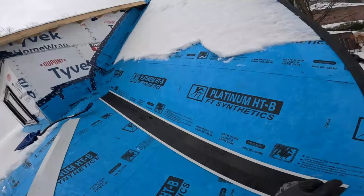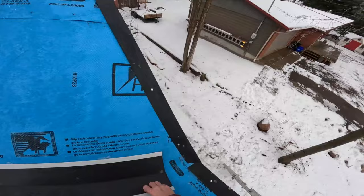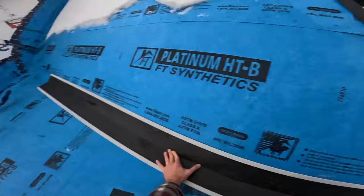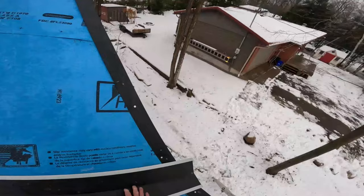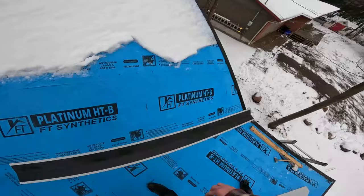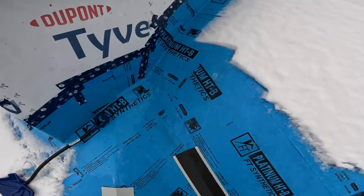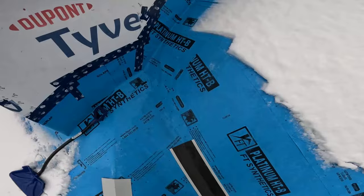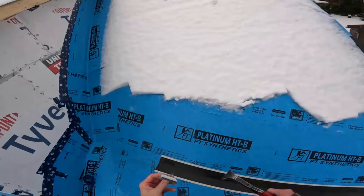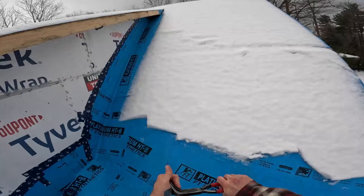Okay, well, it's a little bit webbed down there. It'll be fine. Anyways, I'll run this off the edge there, making sure I'm where I like. Let's go off the edge here a bit. Up here, this is where it's gonna lay. Because I have it overhanging down there, it's not going to go any lower, and it can't go any higher, obviously. You know what? I don't really want to put a screw here. So let's put clips instead. And I'm going to need to grab more of those. So I just take a standing seam clip, fold it down like that, and you have a valley clip.